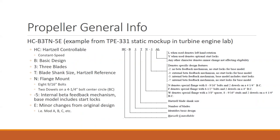Just a review: HC stands for Hartzell controllable constant speed — that designation doesn't change. B is their basic design. It's a three-blade version; they also make a B4TN as a four-bladed version — same propeller, just four blades on a four-bladed hub. It uses the same size blades and blade shank, that's the T. The N mount uses eight-nine-sixteenths bolts and two dowels on a four and a quarter inch bolt center circle.